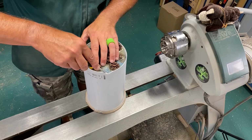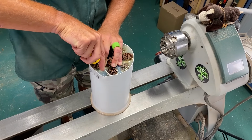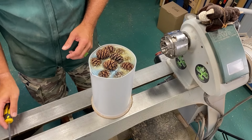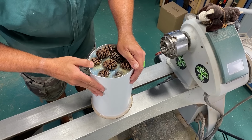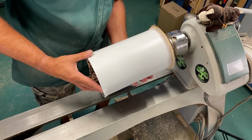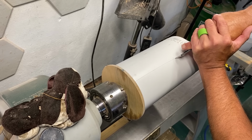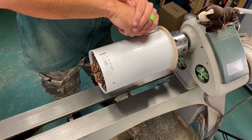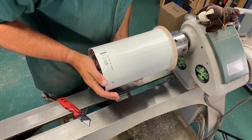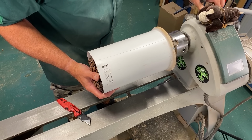Okay, with all my experience, I pretty much have the idea that I could struggle on with this for a very long time and not get anywhere. So I'll put it on the lathe and we'll either cut it off or turn it off, because even though I've broken the edges there, it's not moving at all. Right, luckily we've got a nice worm screw and we can easily get this back on. Okay, I don't think we should rely on the worm screw. Ah, it hasn't come out of the base, it's slipped in the jaws.